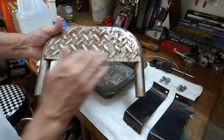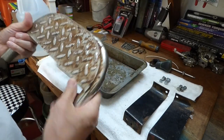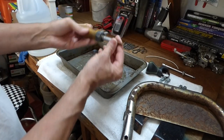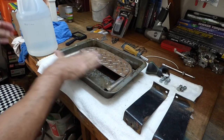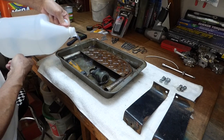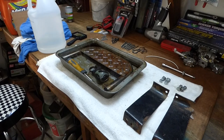I've got it cleaned up the best I could with the soapy water and got the grease off. This side's really rusty and pitted — I'm not expecting a miracle transformation, but I want to get as much rust off as I can. I'm going to throw in a steering wheel handle and a rusty screwdriver tip as well. I've got a pan just the right size and some vinegar — a couple bucks for a gallon. I'm going to leave everything in there four to six hours.